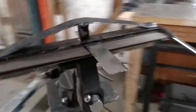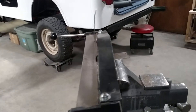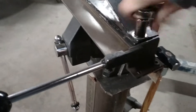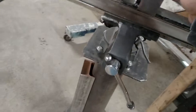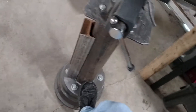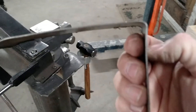Then you just take it and grab the two handles and bend it up until it stops. Pretty close, maybe a little bit over. And you just loosen it — it's so much easier to do with the wing nuts. Loosen it enough or it won't come out. And you pull it out, and you've got your nice 90-degree bend.